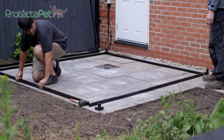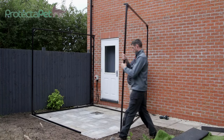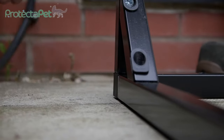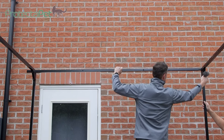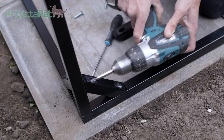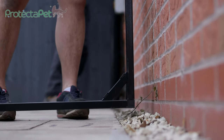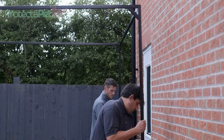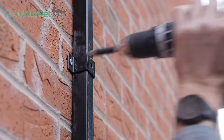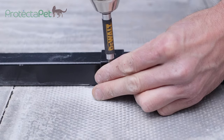Repeat this with the other side of the frame. Once you have the two sides, join them together to create the cube using the remaining horizontal posts — you'll need two people for this part of the build. Fix the remaining diagonal corner braces to make the frame stable, then secure the frame to the brickwork using the top-hat shaped post mount brackets. We recommend using two on each vertical post and two into the floor. Your frame should now be very stable.